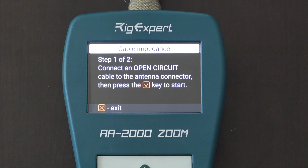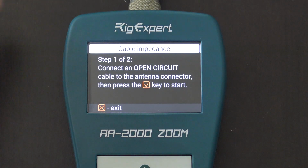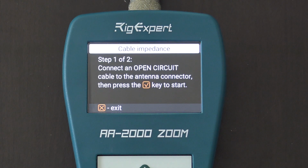If you're struggling to get an antenna to tune, this is why you need something like this, because this will measure the coax too. You might have a coax that's lossy. You might have a coax that's actually resonant on the same frequency and it's radiating. I'm not sure, but there's a lot of factors that this will tell you and why you need something like that.